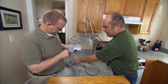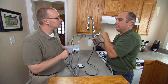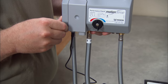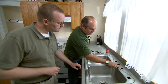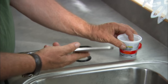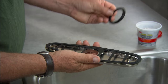There's also the hands-free mode. Once we plug this in and connect the battery pack, when you swipe your hand by the motion sensor it'll bring on the water through the pull-down spray hose. How do you control the temperature? You set the temperature right here, which controls the mix at that point, then it leaves through this hose out through the spray hose. We want a watertight seal between the faucet and the sink. In the old days we'd use plumber's putty, but nowadays they have a pre-made gasket with a soft rubber seal.